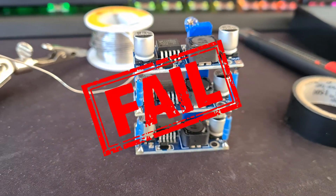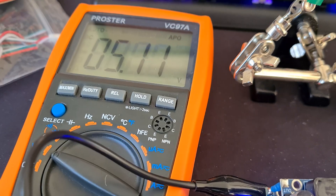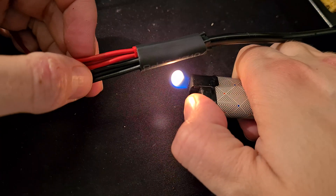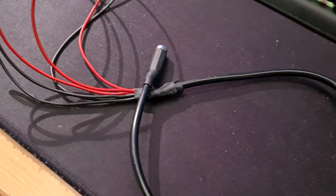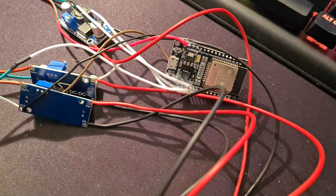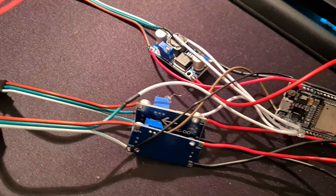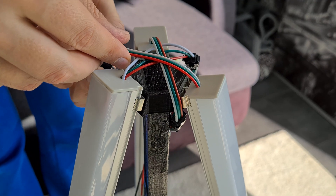Update — future me here. Do not couple the buck converters like that. One of them gets really hot, the next one gets normal hot, and the last one is cold. This will break things for sure. So I changed my strategy and created one distribution wire with a barrel connector at the end and three separate step-down converters, each connected to one LED stripe.